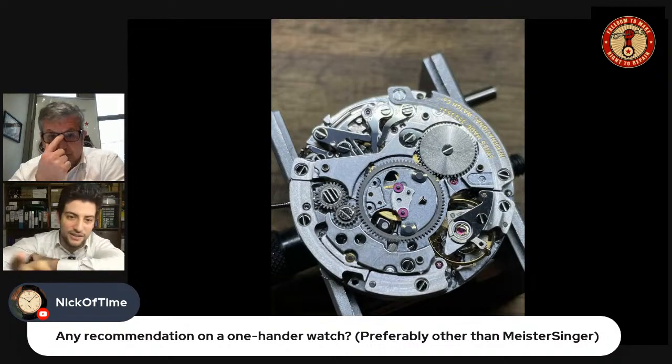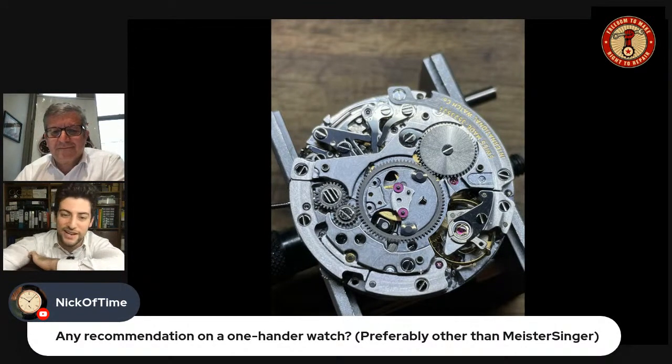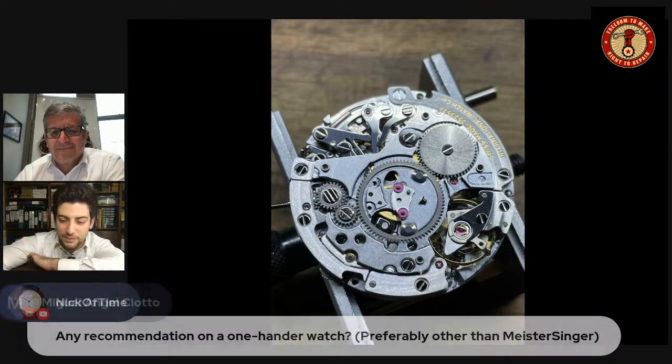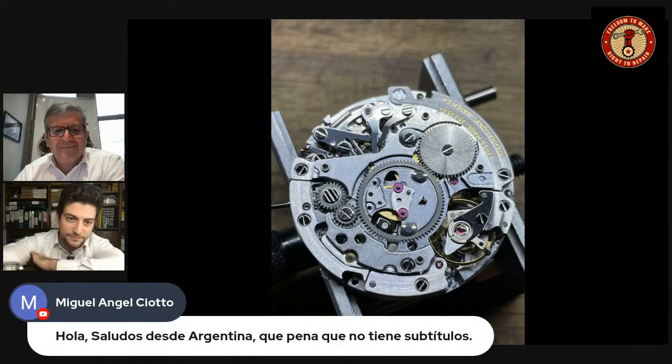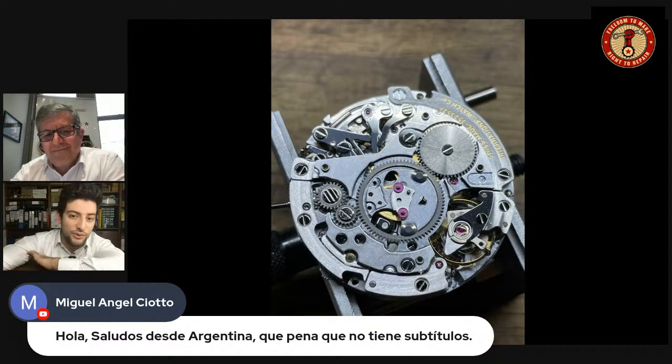So generally the barrel is actually next to the crown wheel, purely just so you don't have to put all that extra manufacturing R&D in between it and the mainspring. But for this particular watch, because they obviously needed more of the chronograph components to be closer to where your pushers are, which is on the crown side, they didn't have any room for the barrel, so they had to come up with a solution there, which I thought was quite interesting.